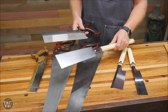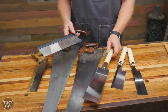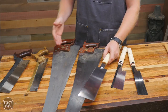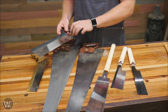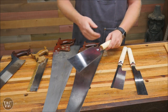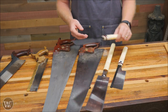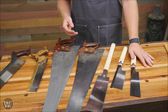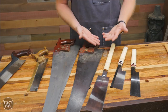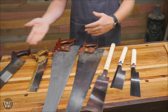So if you're getting started in woodworking and wondering which to go with — Japanese or Western — they're really not one or the other. You can have both, but they do require very different body mechanics since you're pushing with one and pulling with the other. I really don't suggest getting into both right off the bat. Learn one, get used to it, know how to make a straight cut, and then dive into the other. Some people love the mystique and tradition of the Japanese saw, and that's great — but ultimately both do the same thing: they cut wood. It's all a matter of whether you want to do it on the push stroke or the pull stroke. You really can't go wrong.